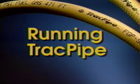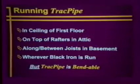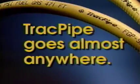Running TracPipe. TracPipe flexible gas piping can be routed wherever black iron pipe is installed and more. Inside wall cavities, through floor joists, over attic rafters, and TracPipe is tested and listed by the AGA for concealed fitting use. As long as TracPipe is properly supported and protected where necessary, it can go almost anywhere you want it to go, even outdoors. For underground use, TracPipe must be sleeved. TracPipe is available in 250-foot lengths on a 38-pound reel.